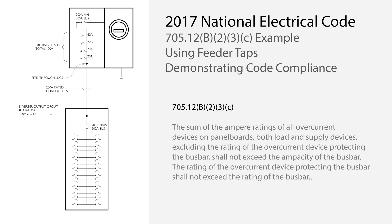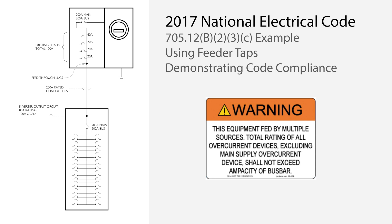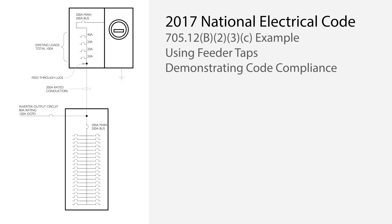There are many ways to use subsection C to result in a compliant interconnection. The key is to analyze the busbar discretely — add up the load overcurrent on each phase of the bus and add any solar backfeed, regardless of whether it is on the bus or downstream on a feeder or sub-panel. If the sum is less than the bus rating, you are most likely good to go. Make sure you add the required label shown in the code subsection to alert future workers that there is a load limit on the bus. Hopefully this helps people who are stuck with challenging interconnections where the 120% rule can't be applied, or where downrating the main breaker is not the best option. Be safe and thanks for watching.